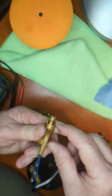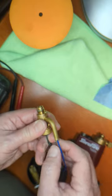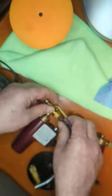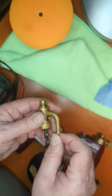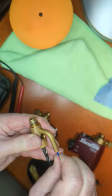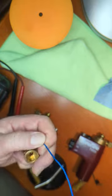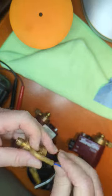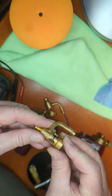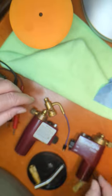It's best to mount this in a soft jaw vise so you can use two hands, because you don't want to shred the insulator — it's relatively thick but you don't want to damage it. If you're taking the wire out, use a soft jaw and gently feed and pull the wire. If you're putting the wire back in, push it in until some of the wire is sticking out, then use your hands. It's actually harder to put it back together than to take it out. In my case, I needed to take it apart because I had soldered these together two years ago and was being very gentle with heat to avoid melting the wire.